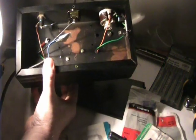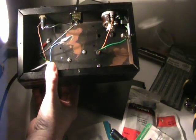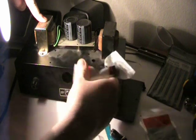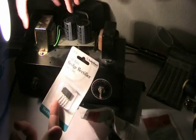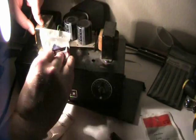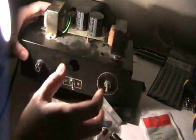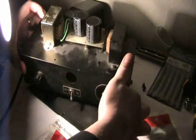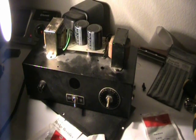This is basically all that's in there. All the stuff on top really is just a transformer, a capacitor, and a bridge rectifier. This capacitor is a third of the size of the old one, so the whole thing would only take up a small space — this unit is huge by comparison. You could easily fit all of it into a children's lunchbox or a skull like that guy did. Check out that video and see how he does it, and between what I just showed you and the diagram links I'll post, you should be able to build one.